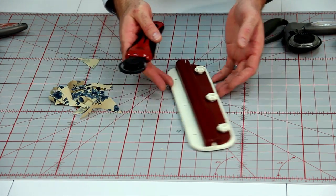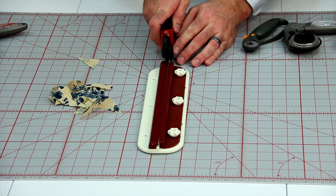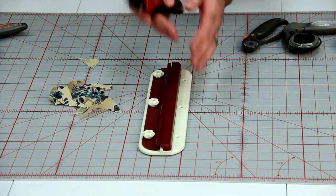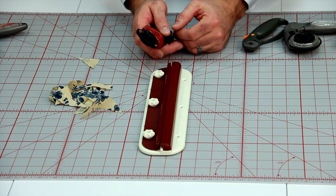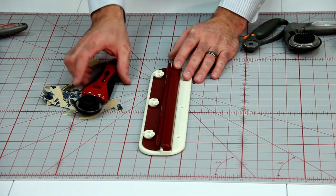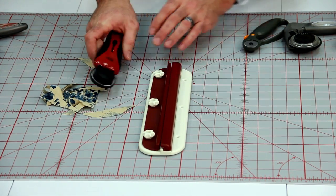Again, a quick repeat. First out of the gate, the first time we sharpen, we're going to start somewhere between 15 and 20 strokes on each side by inserting it down in the edge. Same stroke that you're using to cut. We're going to duplicate that exact amount of strokes on the opposite side to sharpen both sides of the blade. If I start with 15, the second process would be to cut that down to 7, and then lastly I would cut that in half again and then try to see how sharp that blade is. And that's the simplicity behind using the sharpener, not taking the blade out, a no hands-on process. We go directly from cutting to sharpening, and we can go back to cutting.